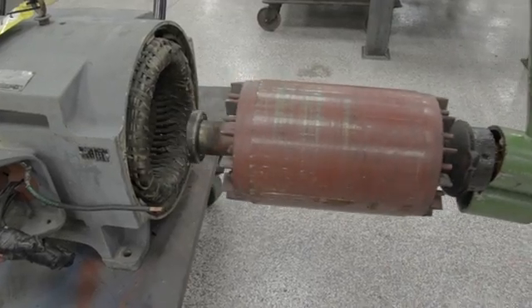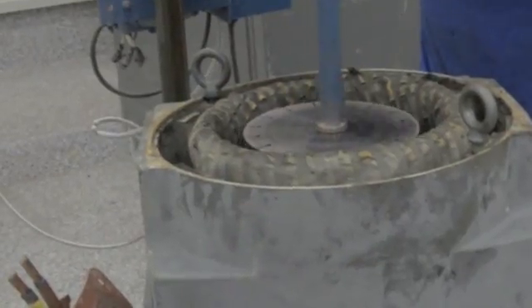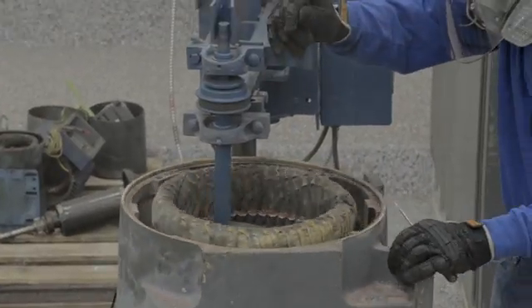We employ root cause methodology to perform a thorough failure analysis and determine what repairs need to be made. Once disassembled, the stator is brought to a special coil cut-off saw, and a cut is made to remove one end of the stator windings. This is so that after burn-off, the winding can be easily removed from the coils after taking and recording the data. The burn-off oven is a high-temperature oven designed to burn off varnish and insulation, making it easier to remove the old windings without damaging the lamination slots.